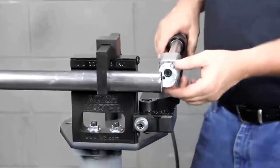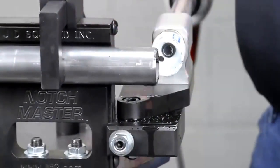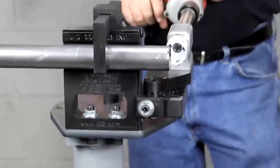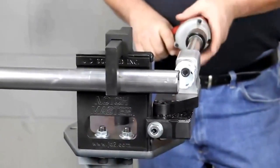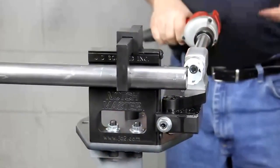Before we do this, one note. This is nothing more than a common, everyday Home Depot bi-metal hole saw — eight or nine dollars. Do not be fooled into trying to buy 60 or 80 dollar hole saws; they work no better. In fact, they'll work quite a bit worse because they're longer and they tend to buckle on you. These here will give you about 200 notches per blade, and at nine dollars a blade, you can't hardly beat that.